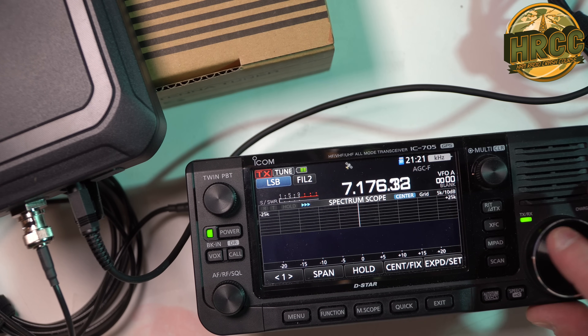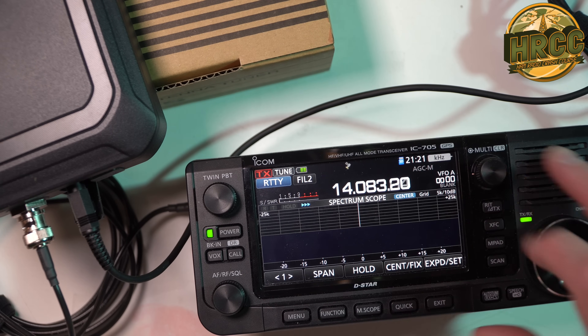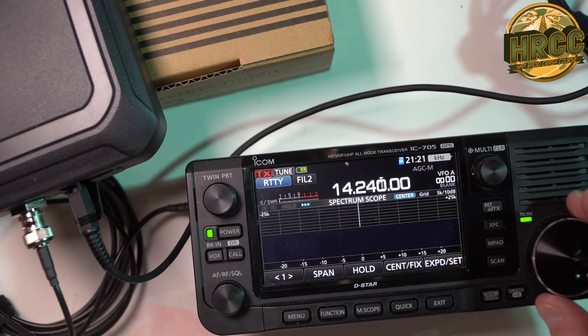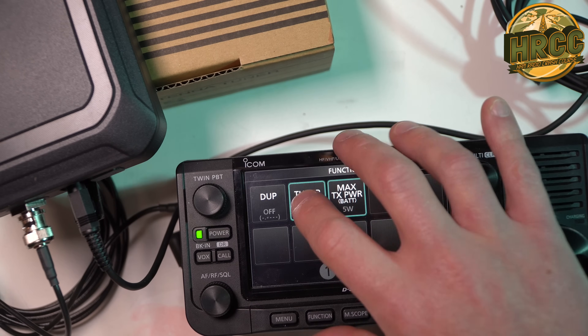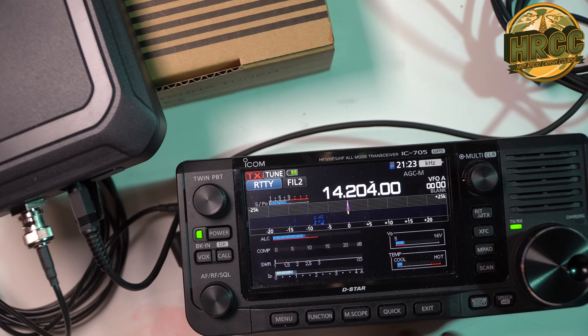So now that the tune capability is on, let's say we flip bands. Let me go up here to single sideband, let me go to 250 here. Change it to single sideband. Grab your mic cable. And if you go into meter — flat SWR right here. Let's tune around a little bit.